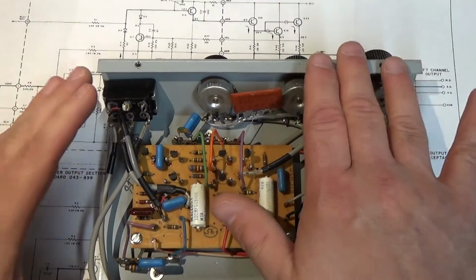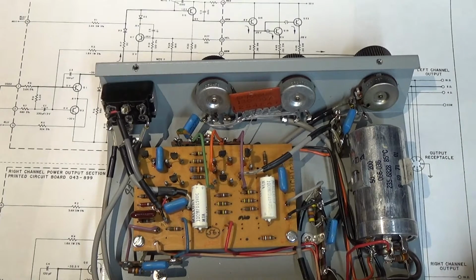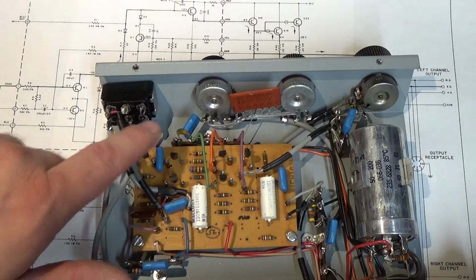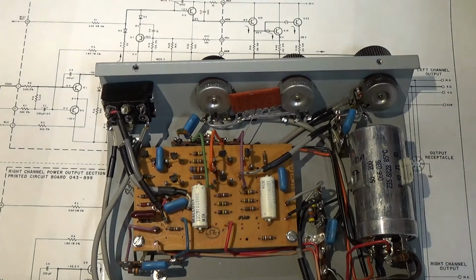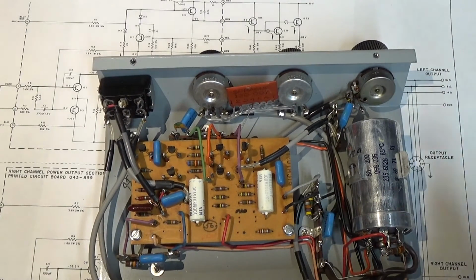When I say that, the minimum signal my signal generator can put out is 1 millivolt RMS. That's it, which is tiny. If I put 1 millivolt into the tape input on this, I can drive that amp into clipping very easily by turning the volume up on this. So you can imagine how much gain this thing has. So it is very susceptible to noise. So I don't know how much I'm going to be able to totally eliminate the noise, but what I can tell you is I'm going to do my best to get it as much as possible.